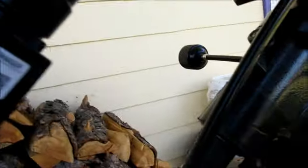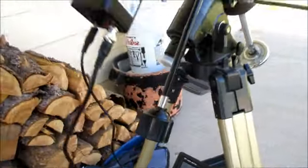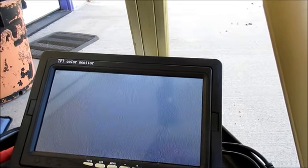Now, having done all that rewiring, the question then becomes, does it still work? Flipping the power on in the battery automatically initializes both the CCD imager, as you can see with the red light turning on, as well as the screen. Notice all the noise on the screen. That's an indication you're not getting any real light, and all it's doing is stray discharges of the CCD pushing itself to the point where it's overly sensitive.